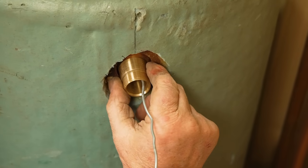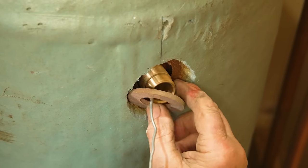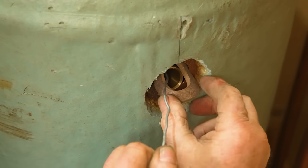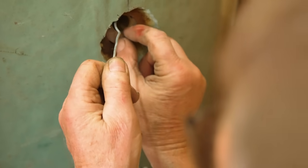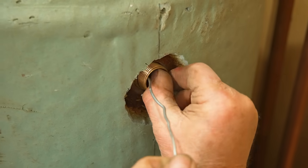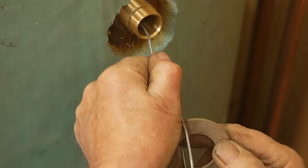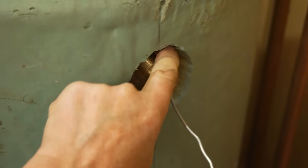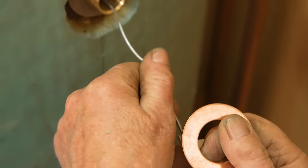We need to put the washer on the inside - this also has to go inside there. These are rated for 60 degrees Celsius, by the way. You can see that pulling against the body now. Next washer goes on the outside, so we've got a double seal. Make sure there's no debris around there. We put that one on, then we put the brass washer on.